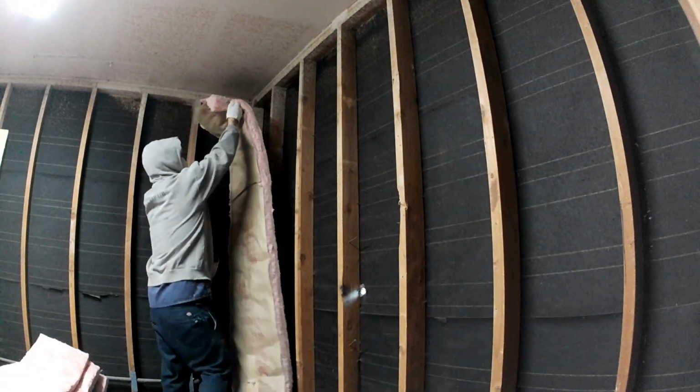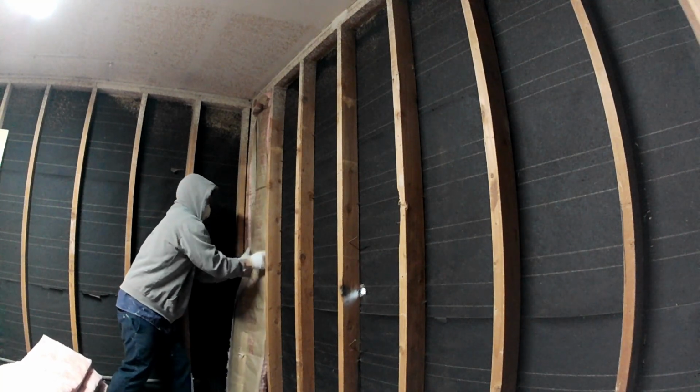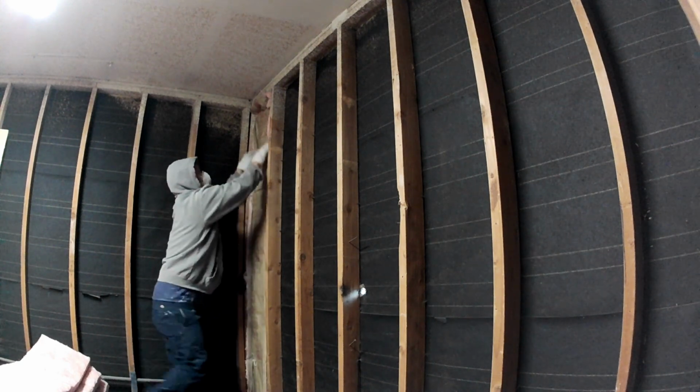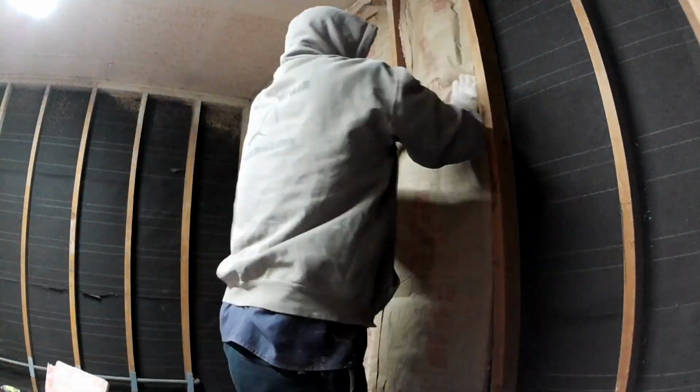You want to cover gas pipes, water lines, electric lines. They're basic hammer-on framing plates to protect it. Not only for me putting sheetrock screws through and hitting the pipes, but if they install cabinets, pictures, anything getting hung on the walls, screws go through, that way it protects it. Especially wires. You don't want to put a screw through a wire and then you get a short, and then it's hard to trace that wire mistake in the wall. So it's easier while these walls are open to put metal brackets.